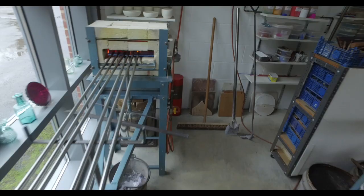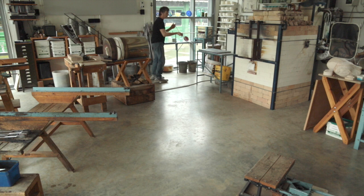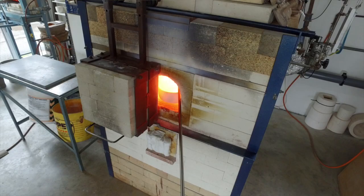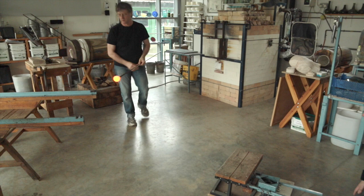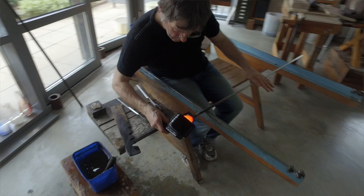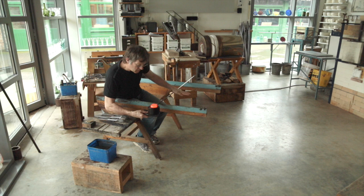When we prepare to blow the glass, the first thing I do is to gather some glass from the furnace. I take a gathering iron and dip it into the molten glass and rotate. After a few revolutions, there's enough glass on the glowing iron to remove it from the furnace, and to take it to the glassblowing chair or bench and prepare it for blowing — in this case, by blocking it using a wooden block steeped in water to stop it from burning. That gives the glass a basic ball shape, which I can then adjust. First, I have to introduce air into the glass by blowing down the blowing iron to create a small bubble in the glass.